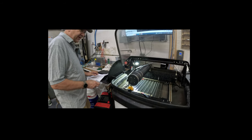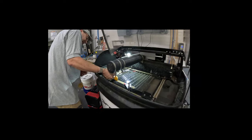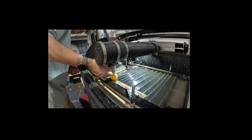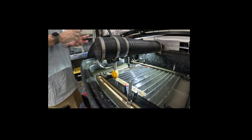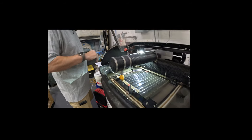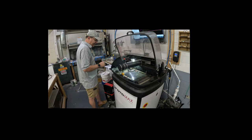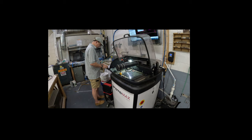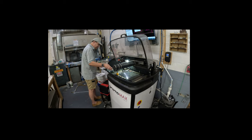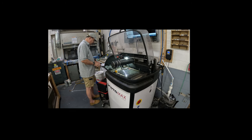Make sure that the garnet hose line is firmly pushed into the back of the nozzle. You may find it's been disconnected because the previous person drained the nozzle to make sure garnet wasn't left there. It should push in about a quarter of an inch and you'll feel it after you've done it a few times.